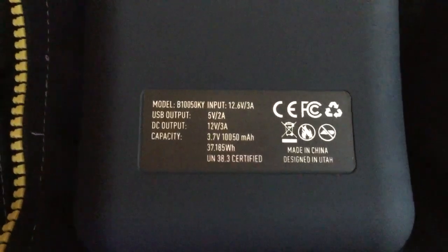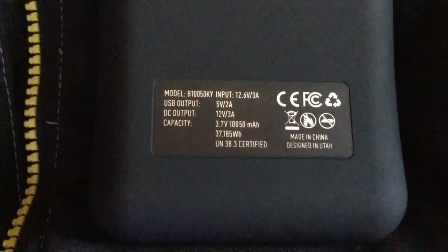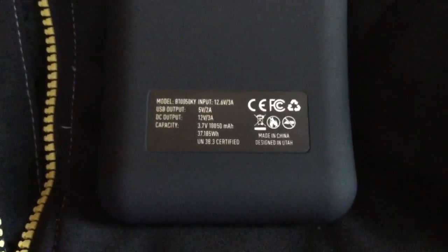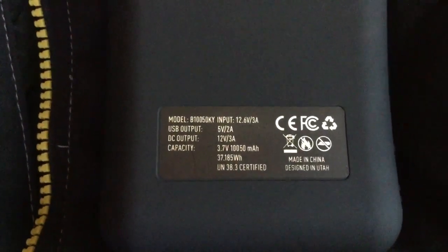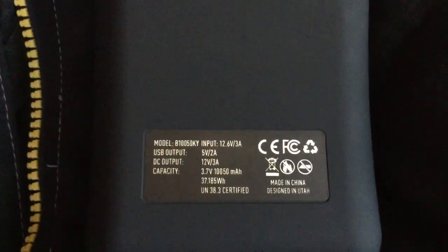Focus. Get the camera to focus on this. This is the battery pack that came with it. It's 37.185 watt hours. And I did some calculations and I worked this out to be about 3 and a bit amp hours. The yellow battery pack you saw a minute ago had 4 amp hours, and this has a USB port, 5 volts, 2 amps. The 12 volt output can output up to 3 amps,